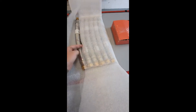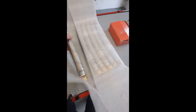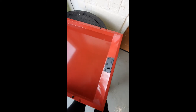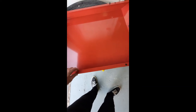There's also a parcel labeled 'plastic' — when you open this up you will see that inside we have some flexi hoses. These flexi hoses are designed to connect onto the back of the unit so that you get no vibration into your pipework. Inside this pack there are actually a set of six of these for each of the pipe connections. If we head over to the back of the cover we removed a minute ago, you can see the plug where your remote controller goes in, and the little plastic clips which hold the lid on — so notice there are no screws, it just sits nicely on top of the unit.